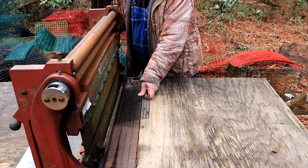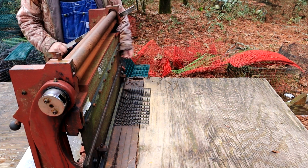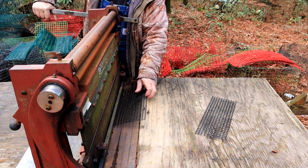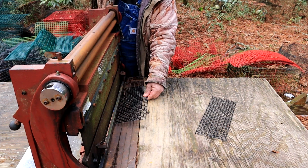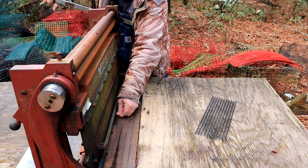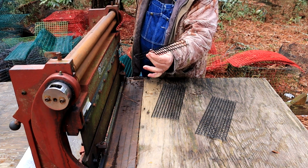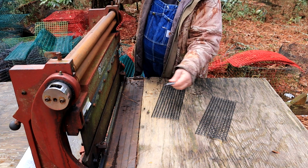And then I'll slide this up here like that, set the cutter, and then cut the edge of the panel off. Then I'll trim off the, I guess you can call them prongs, on that side of the bait well, and then I'll do another 10 meshes. If you pay attention to what you're doing, you won't have any waste. But you need 10 meshes, you've got a 22 mesh wide panel, you're going to have 2 left.